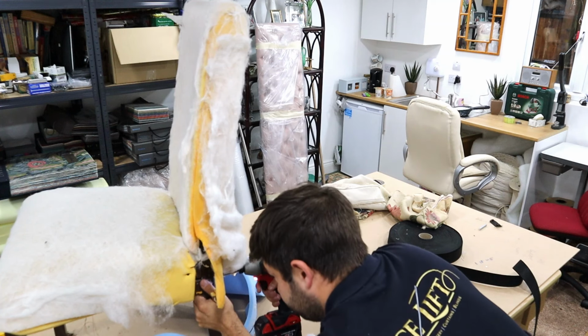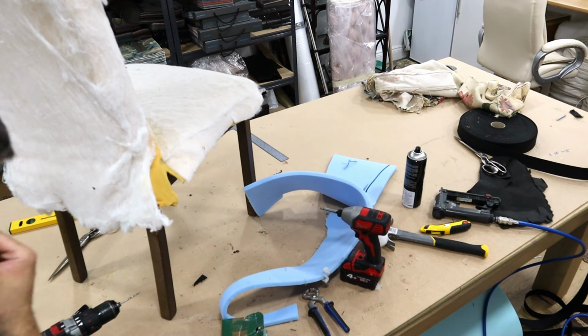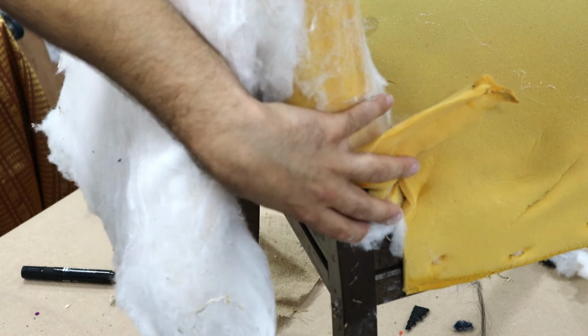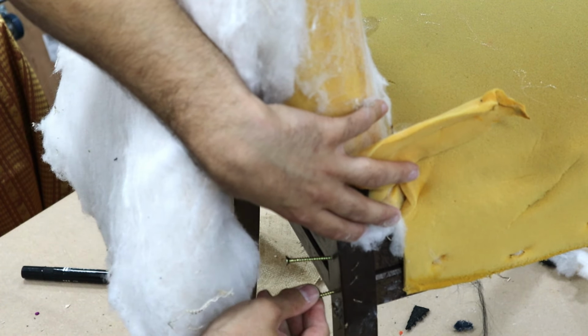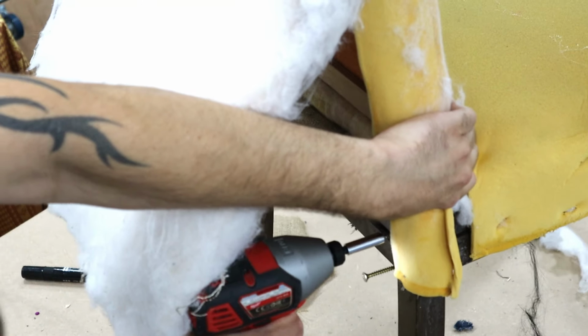What I'm also doing is I'm going to stick some screws into the frame. It seems a bit wobbly. Sticking a couple of screws in because the frame's a little bit wobbly and that'll tighten everything up. So this is the join here. So I drilled through there. And likewise there. That's where the dowel's going to be. That's where the wood's going to be joined and glued.